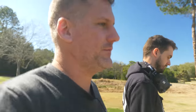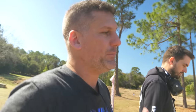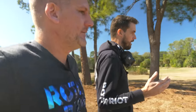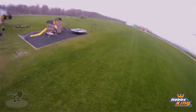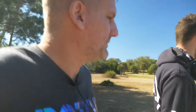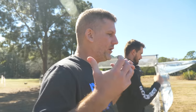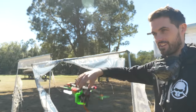There was a point in the history of drone technology where yaw made a huge leap, and I was super excited because I could actually do a really fast yaw. Up until that point, yaw was really slow. The best way to get good yaw back in the day on a multi-rotor was to build something with an articulated motor, like a tricopter. That's why tricopters happened: yaw on anything relying solely on vectoring the angular momentum just didn't work that well. But they figured something out and got the yaw performance to be amazing, to where it actually surpassed tricopters.